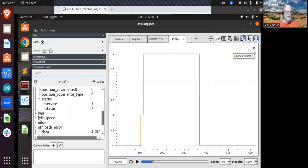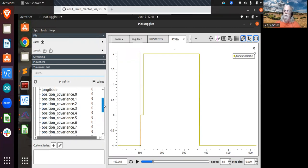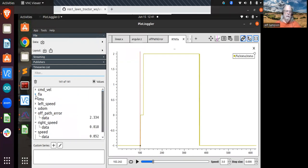I think there's something else too. Oh, the other thing is, you may want to look at, again, depending, you may not have, you're saying you switched from ROS serial to something else, so you may not have this, but I would like to see you print out the command velocity and print out the Ackerman and compare those, because that command velocity you're using is not steering angles. So it would be good to know what you're trying to get this thing to stay on your path, which it doesn't have a path. You've just got the endpoints. But anyway, if you could get the Ackerman, get the actual thing that it thinks is steering angle out of that, it would be to your advantage.